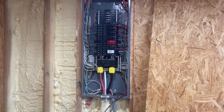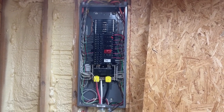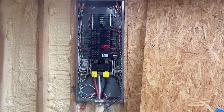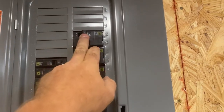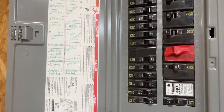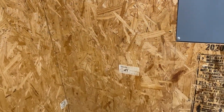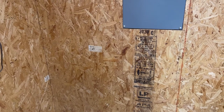We're down to the nitty-gritty as far as the kiln. I've still got to hook up some plumbing, but the hardest part of the electrical is done. Hooking in that last breaker won't take me five minutes. When the rain cuts off I'll be back out gluing PVC to finish the waterline and we'll finally be able to turn it on. We got the wall put back together. Inside the panel, our new 60-amp breaker is still off for now, and it's labeled up for the kiln. The 20-amp for outside will go here too. We planned that this piece of OSB is screwed on so we can take the panel off without taking the whole OSB off the wall — we've had to do that several times to work inside the electrical panel. Smart planning.